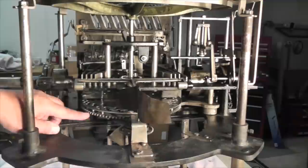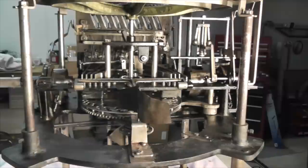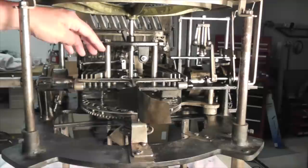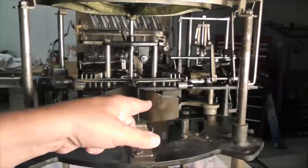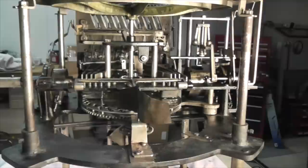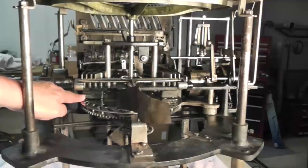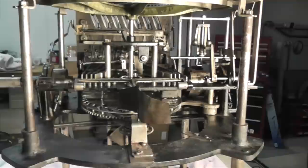When the ball gets caught in the lever, it will allow the individual horizontal payout detection levers to drop into a hole. If a color was selected that lines up with a hole, the horizontal lever will continue the drop, cause this lever to raise up, releasing the timing fan, and then this large gear will cycle, and as it cycles, the two coin payout mechanism that is below the coin tube will cycle, and there are little tabs on this that will hit the corresponding pin. That dictates how many times this will run, so whether it pays out 2 coins or 50 coins.